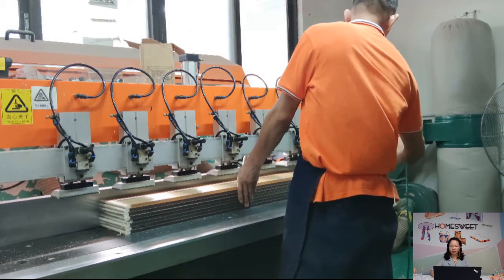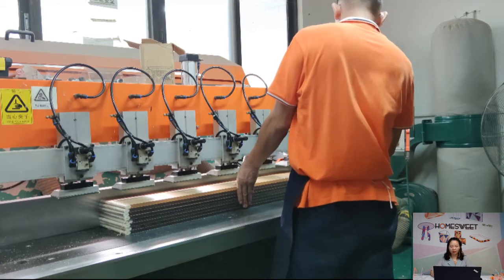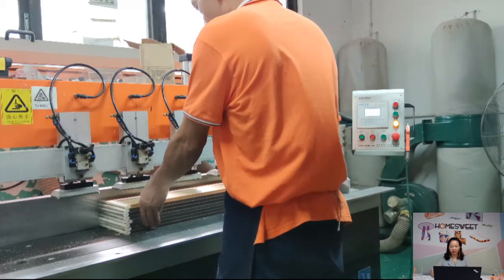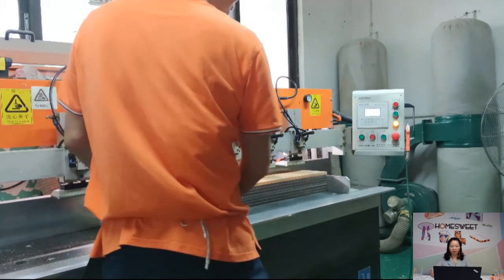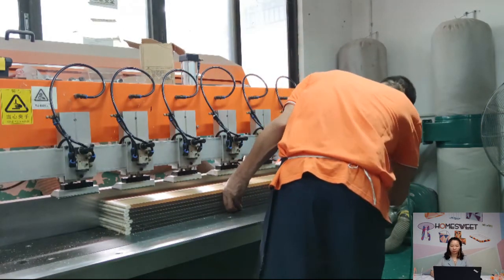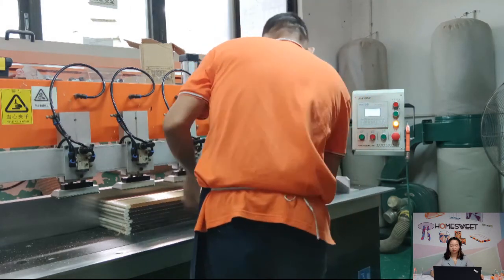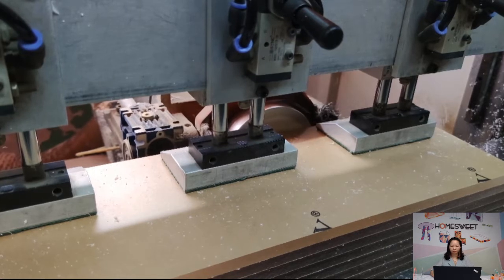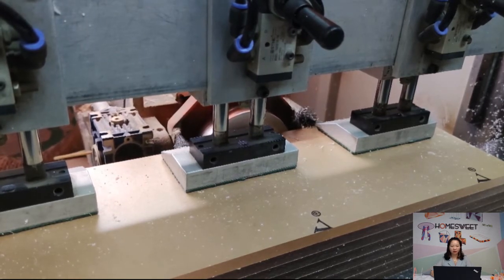After cutting, the next process is polishing. It is a very important step for the acrylic. After well polished, the acrylic can be highly transparent. For standard square size, we will use diamond polishing machine, as you can see in the video now. It is a fast, efficient polishing method, and for one time we can polish dozens of acrylic pieces. Let's see how it works. The polishing speed is quite slow, but it will ensure the acrylic edge is very smooth.